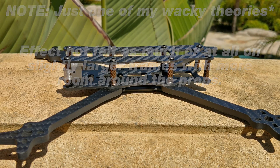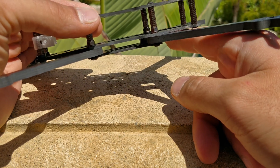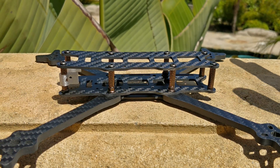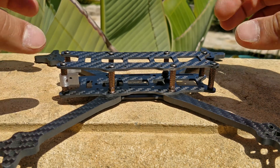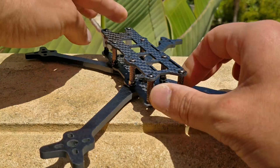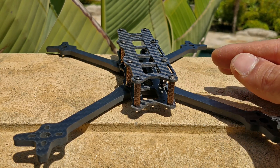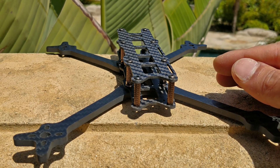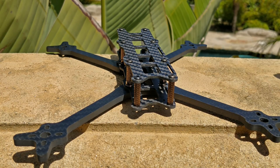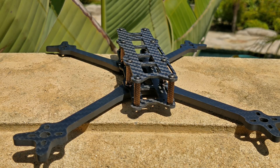On the Fluoride frame, you may have noticed the back is chopped off — it doesn't have a lower part of the back, just a top deck that extends off the back where you strap the battery. This frame is narrower — 27mm standoff width. By the way, if you have 27mm standoff TPU accessories, you can use them with this frame, which are the accessories from the Tooth Fairy. I know Brian Phillips has a whole slew of designs, and I feel like 27mm should be the new standard going forward because it fits micro cameras perfectly.